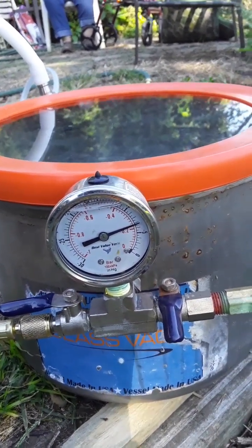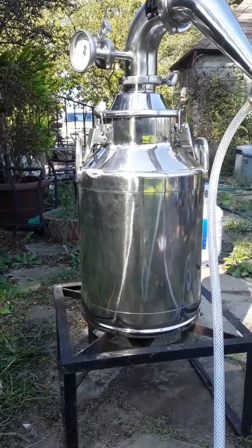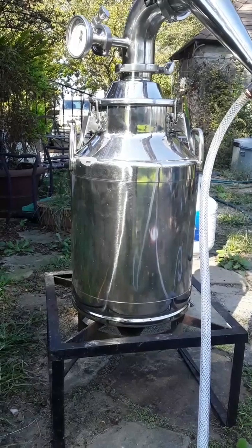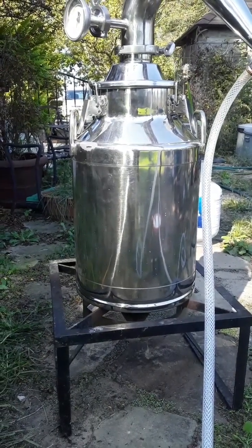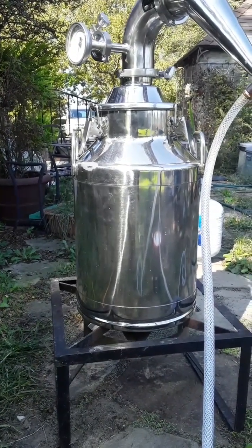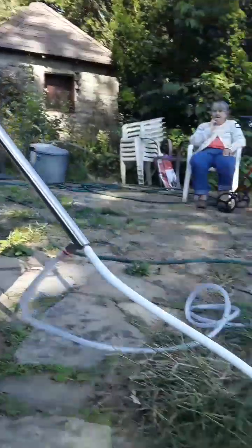I can see the vacuum is increasing and it's going to get to about 80%. A lot of people might be afraid of the still collapsing — I'm actually a structural engineer, and I found a formula for stainless steel that says as long as your wall thickness is at least 1% of your vessel diameter, you should be safe from buckling collapse. This still has about a 3mm wall thickness and about 300mm diameter, so it meets that 1% criterion, and I've confirmed it evacuates to 80% without any deformation.